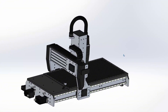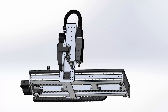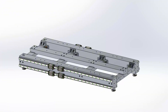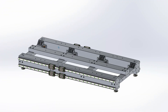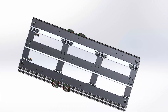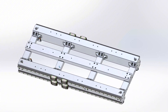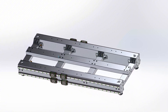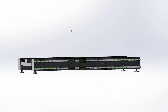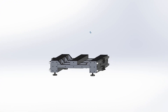Still I wanted to try something different, something better. I checked my own machining capabilities and thought I might try something crazy — solid bars instead of profiles. So I redesigned the machine base accordingly and compared the cost of both designs. To my surprise they were not too far off, even with the better end for the solid bars. With the new design the sagging would be reduced to less than 0.03 mm, about a quarter of the profile design. That was good enough for me.